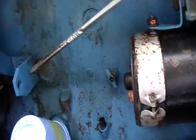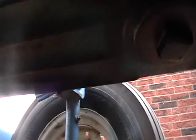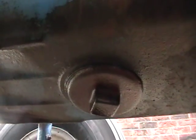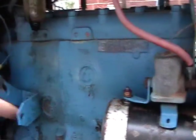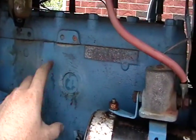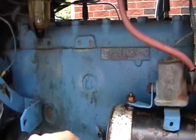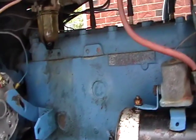As you can see, it's pretty clean. Whenever you're changing these — I don't know if you can see that big old bolt right there — that's the drain plug. Whenever you let that thing loose, it's almost immediately drained. I figured I'll get one of those little aluminum retrofit ones that you can put on a screw-on oil filter. Those would probably get a little bit better filtering than the canister, and I figured I could get one for close to about the same price.